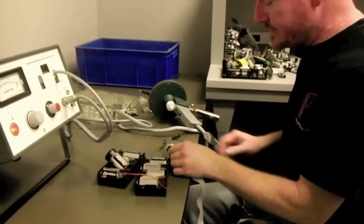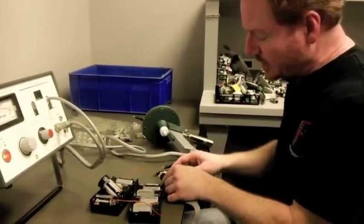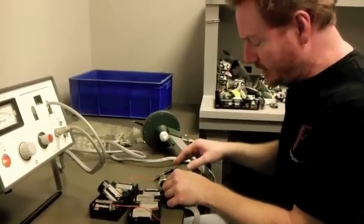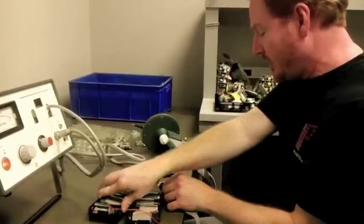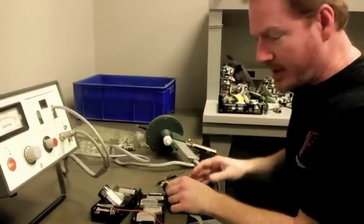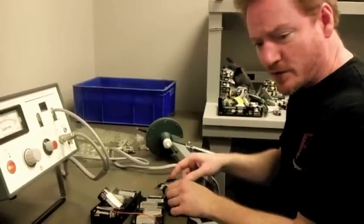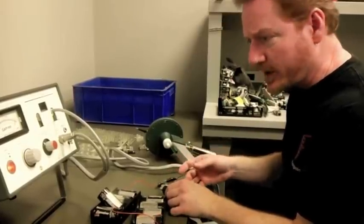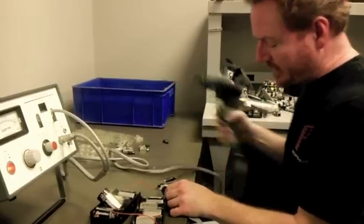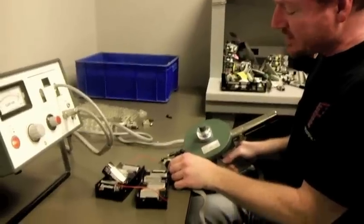What we're going to do is — I've got this laser diode protected by Lasorb, and I've got a simple battery-operated laser diode power supply here. When I put the battery on, you can see that the laser operates. I can't run this continuously because without a heat sink this laser diode will stop working eventually. So what I've got here is protected by Lasorb, and we will go ahead and hit it with 20 shots a second.